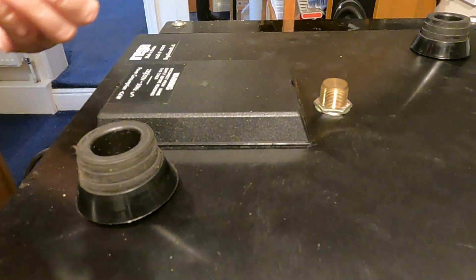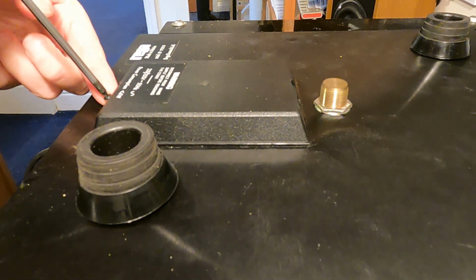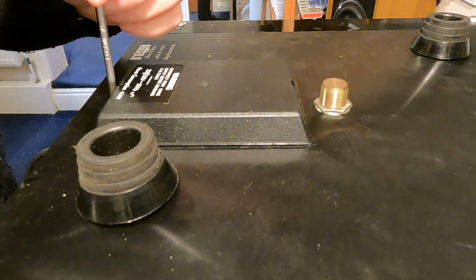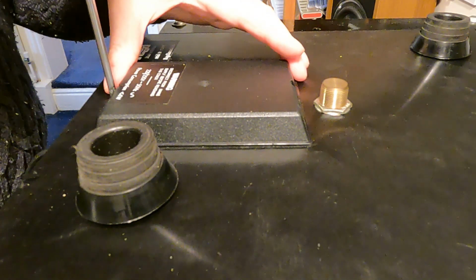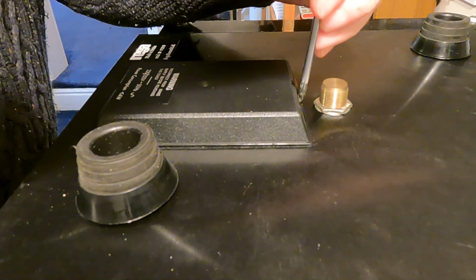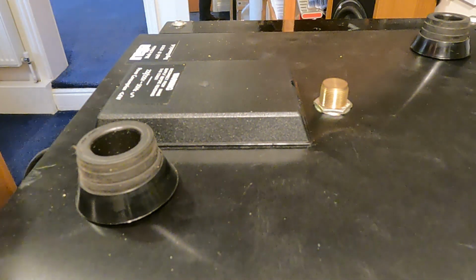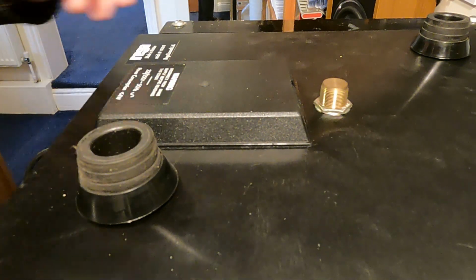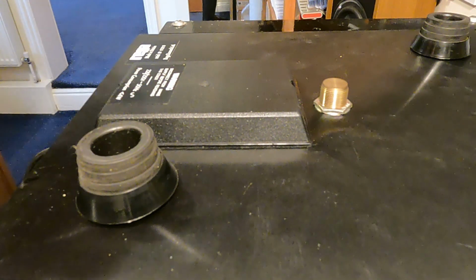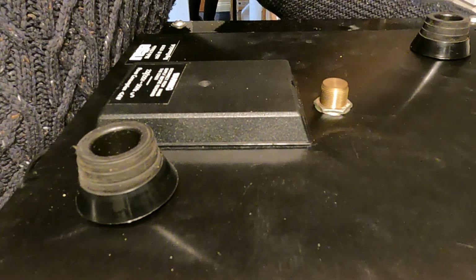Put the board back. And that component's basically, I don't know, 30-40p from RS Components. You probably pay £2-3 postage, I would guess, something like that. So you're basically fixing your Rega for about £4. I've seen people quoted quite extortionate amounts for new motors, you've got to have a 24 volt kit and all this sort of thing, and it isn't. It's just cap failure, really.